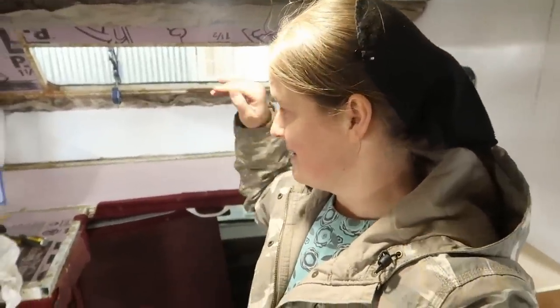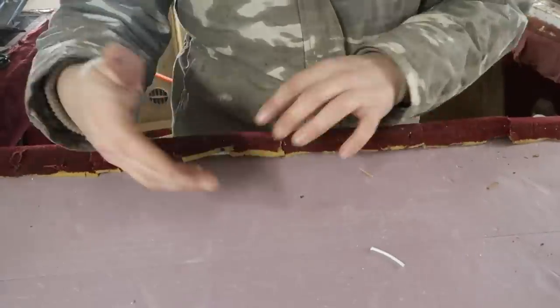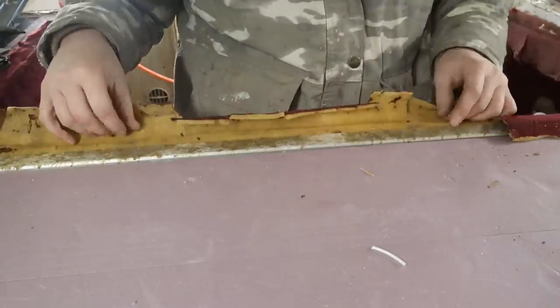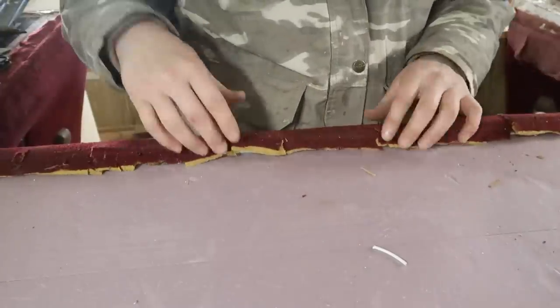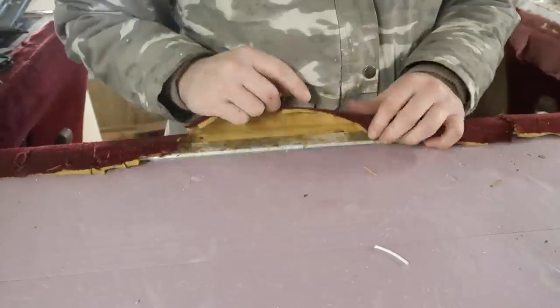Now I think I'm gonna start working at just building the bed frame. I'll just let the ceiling panels wait till he can help, because that's gonna be a little bit tricky. So this is the edge, this is the carpet that comes up from underneath. So I'm just gonna start by running some glue under this and nails under that, and then we're gonna bring the plywood up to the edge.